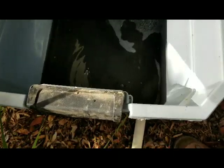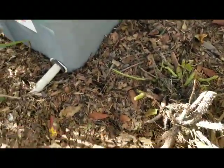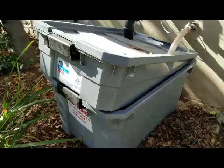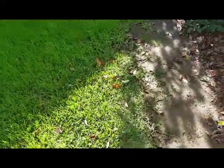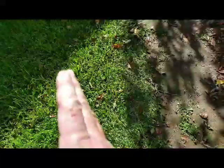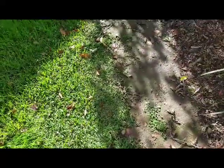There's a little bit of water still in there because the pipe itself is a little bit high and the tank is angled kind of backwards, so we'll just readjust that right now while we're here. These brown spots are mainly because the pipe doesn't start until farther in this direction — a lesson learned. We have to bring the pipe all the way to the full edge of where we want the water to go, because there's only capillary action and flow perpendicular to the pipe.